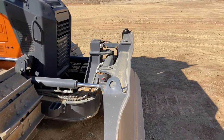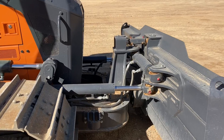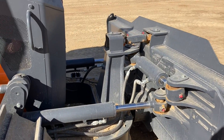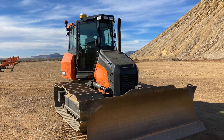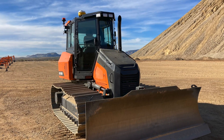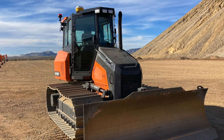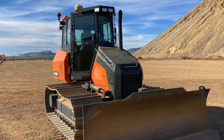To control the pitch angle, you use this mechanical screw, adjustable from 50 to 58 degrees — whether you want to roll material or dig. We can adjust it here mechanically. So in total it's six-way hydraulic and two-way mechanical control.